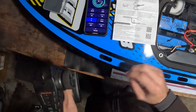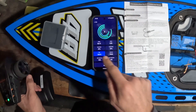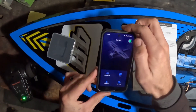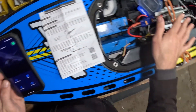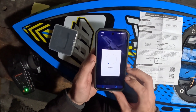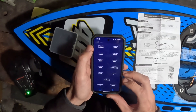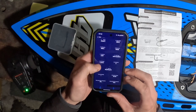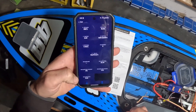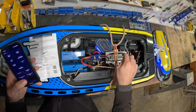I know why it's BLE. So this should be live, I think - data, yeah, cool. What do we go to here? Settings - I'm guessing that would be to change stuff either in the app or on the phone, not 100% sure, I'll look into it. So we've got a 3.2 cutoff. Max RPM wasn't logged for whatever reason, but we've got max amps, which is more important, and max ESC temperature, also more important.